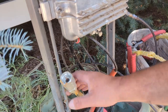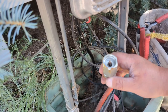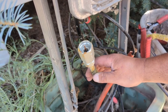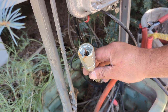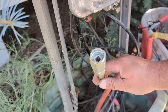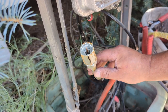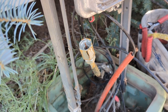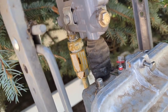We got it cleaned out, got our shrink wrap off. There's heat shrink that goes around these fittings that we cut off and take off with a blowtorch — I'll make another video about that, and you guys will get to see me put it back on when we cut the new one in. This is P3 500 line, typically used as a distribution line which feeds taps. You'll occasionally see it feed line extenders, but we like to use trunk line traditionally. So that's our input, and up here's our output side — got that one cut off too.